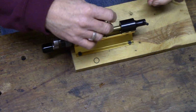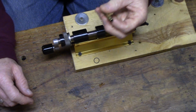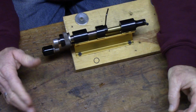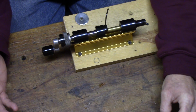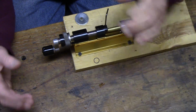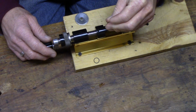I've taken a mic on a lot of these things. 10/1000ths of an inch thick on the neck is the thinnest I've seen on anything. They go anywhere from 11 to 13. I had one that was 14/1000ths. That's quite a bit. So we're going to trim them down. We're going to take the high side off. We're going to leave that low side at 10/1000ths. All you got to do is start monkeying with it.